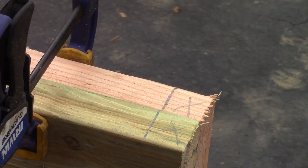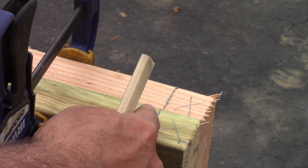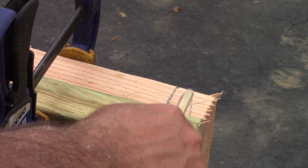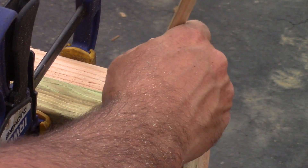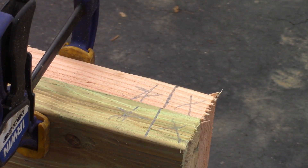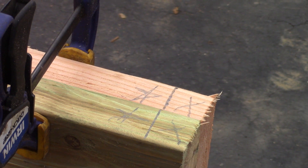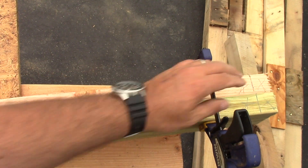On the end of the board you're going to have a full stud, so I've marked an inch and a half on both boards and put an X where the stud goes. I'm also putting a star there so that when I lay out the wall and nail it together, I'll make sure both stars are on the right-hand side to keep things lined up.